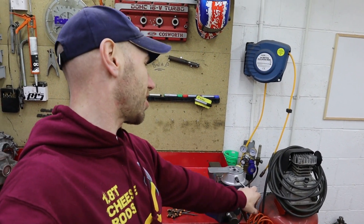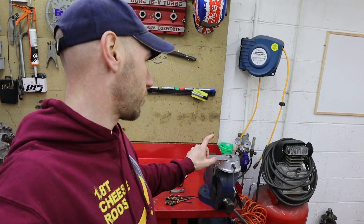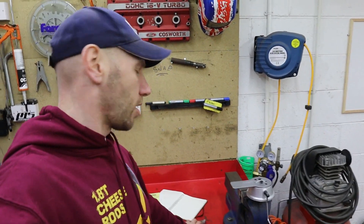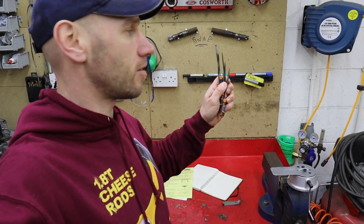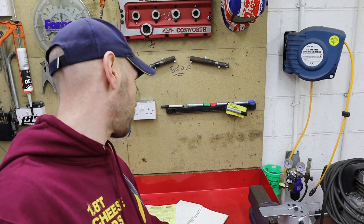In all seriousness, let's get on with the rings. I've got my ring grinder here, out of hibernation. That's what I generally use for the coarse cuts, so if there's lots of material to come off, I'll do it with the ring grinder. I've also got my needle file set, which I use for doing really fine cuts and deburring of the rings. Feeler gauges to measure it.